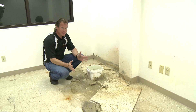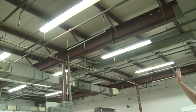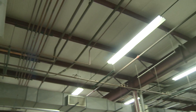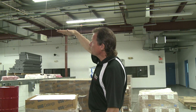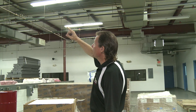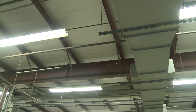Another issue addressed by spray foam roofing is the reduction of heating and cooling costs. In a typical commercial building, we have metal girders and metal purlins going across the girders. The insulation is only approximately two and a half inches thick, and it's draped across the purlins before the metal roofing is screwed down. So this insulation has very little R-value, and it has no R-value where it's pinned down to nothing between the metal roofing and the purlins. We have very little insulation in the roof.